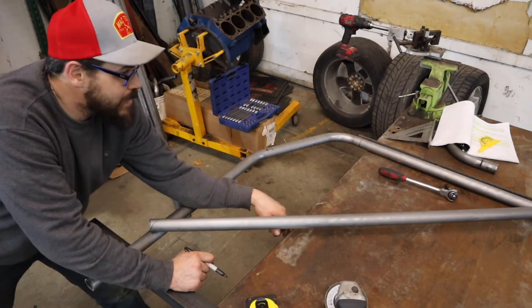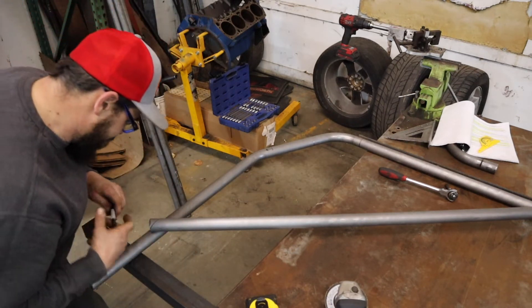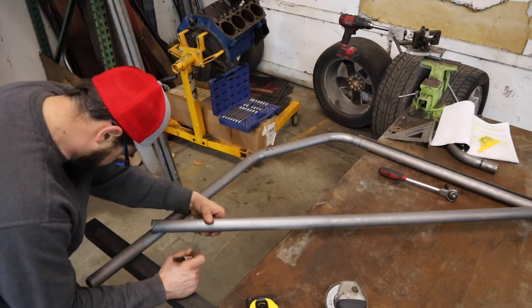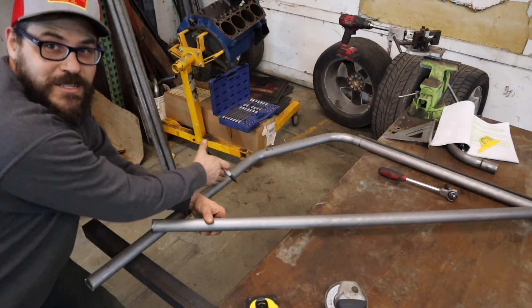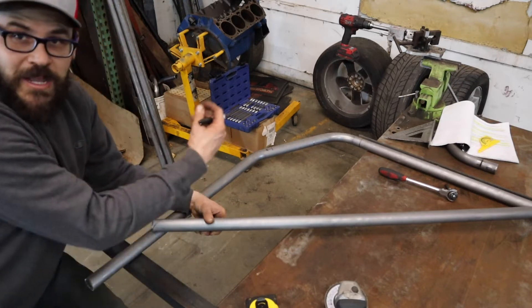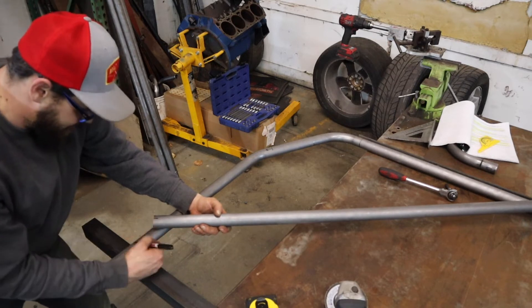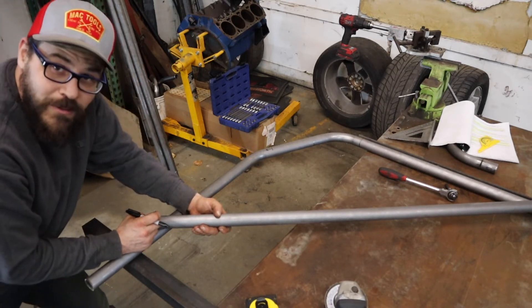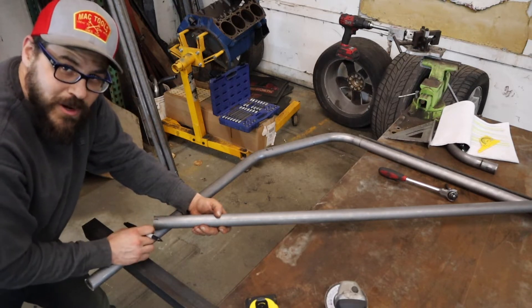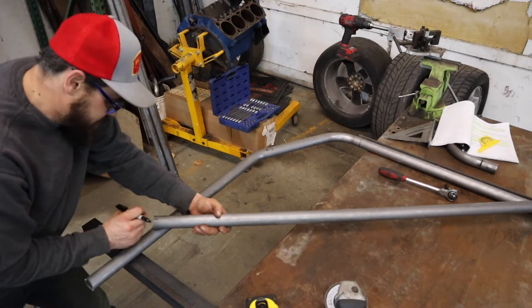The tube is going to be at about 48 degrees. You're just going to eyeball down your tube and mark out parallel with it. I didn't have to measure it — you can eyeball it in there. Then you're going to make a face line, the line where this is going to attach to the tube. We need to cut out one-third the tube diameter for the tube to sit on top of the tube, which in this case is just going to be half an inch up from our cut.